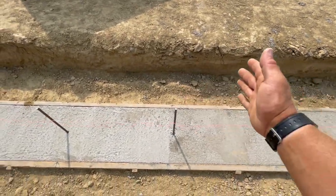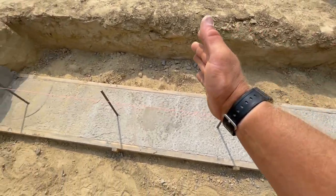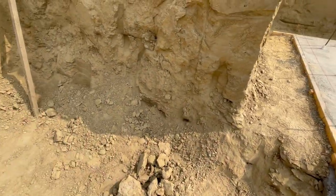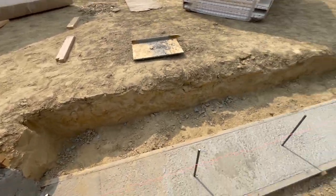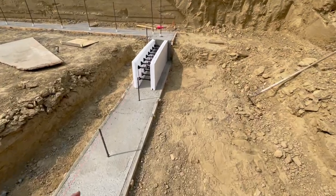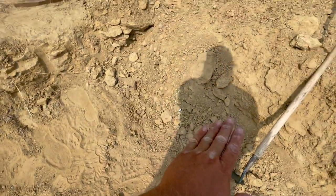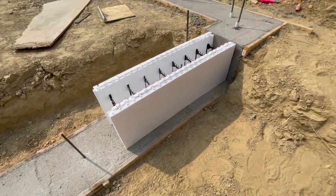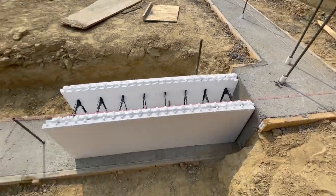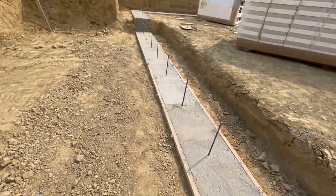Passenger door — three foot. Then a 77-inch window, then solid wall. This jump footing is because there's a retaining wall in here that comes back, so that's why we've got this. Once this little stub wall goes in, big sheets of foam will sit right here, perfectly square to that, and come out four feet — and that's what makes it a frost-protected footing. We're actually going to put foam here and foam there just to double-whammy cover us.